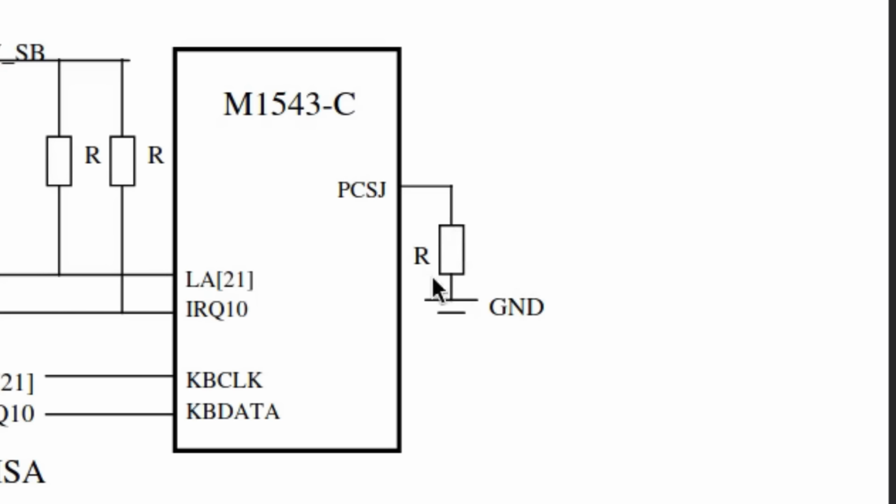And I would like to check if this one would show any signs of slowing down when using K6 Plus CPUs. I have here an AMD K6-2 Plus 550, but I will leave the multiplier settings as they are, so the CPU will continue to run at 450 MHz. I'm curious to see if there will be any slowdowns, and if not, then we can compare a K6-2 against a K6-2 Plus clock for clock on this board. Let's give it a try. I'll just set the voltage down to 2 volts as required by the CPU to avoid any unneeded stress on it.